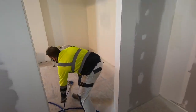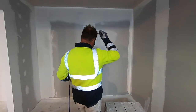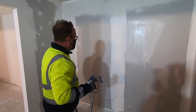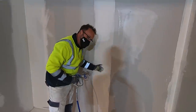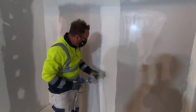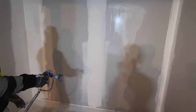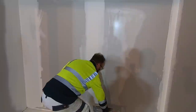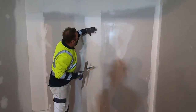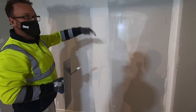He's going to show us a tip now. If this was only a standard joint that's been filled just once over, you've got a little bit of a concave element to it because of the tapered edge board — suction and curl which is normal for most materials. Always spray a bit of material up onto that element, give it a wipe straight away — don't wait. It's like dubbing out, really — just fill your joints like you would when skimming, let that pull in. Because you've got something already there that will pull in fairly quick. That helps you out massively — do that, let it pull in for a couple of minutes and continue with the wall.